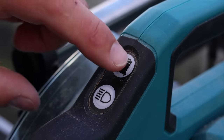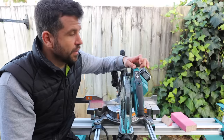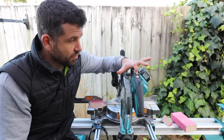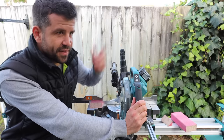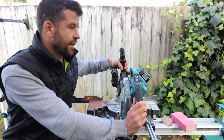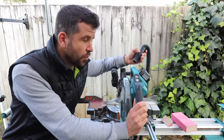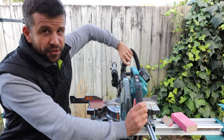Also up there with the light switch is the vacuum switch. You don't press that to make a cut — as long as your Bluetooth is paired, pulling the trigger turns the vacuum on. But if you press the vacuum button manually, press it again and after a few seconds it turns off. One good thing: you can press that button, remove the blade guard, and clean the base of your saw without having a spinning blade near your hands. I really like that.